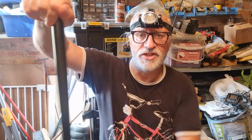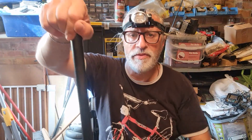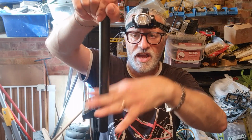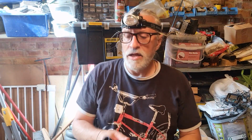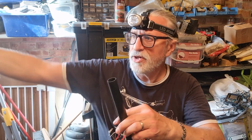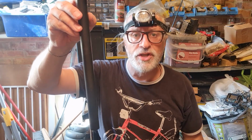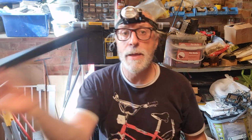Yes. So, a little bit of tubing on your fill-up valve inside your tank. Just fix it on there, either with tape, or you can do a more permanent solution. That sits in the water. The water then fills up, and you don't hear all that filling of the tank. Now, I don't know if that's within the regulations, i.e., potable water and all that sort of thing. But it can't be, because it's coming from a feed. It feeds other tanks, so it's not exactly going to go back in, is it? So that was my solution. I don't care if that's right.